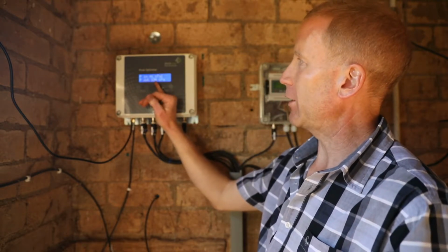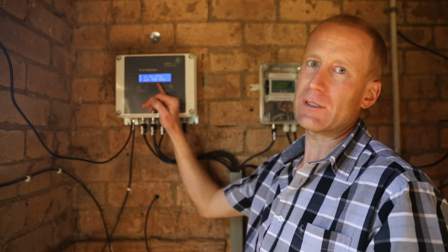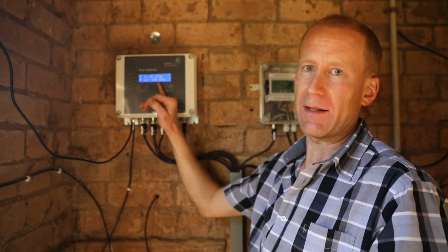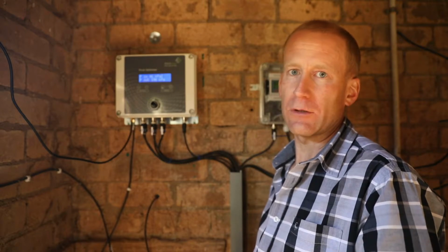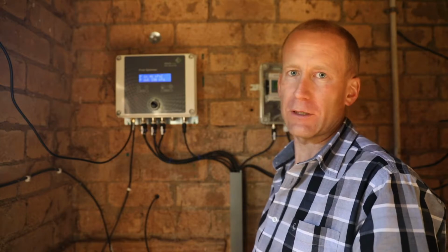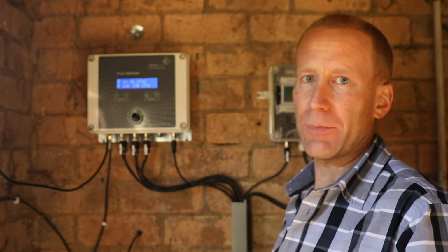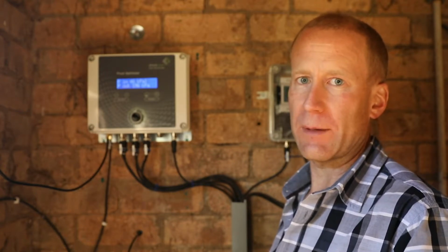The pressure outlet value that we've got is 196 kPa. In this case, the outlet pressure sensor has been installed after the non-return valve, so it is picking up the static head between the pump and the pivot center. In this case, 196 kPa corresponds to about 20 meters of static head between the pump and pivot, which corresponds to the physical installation. The Pivot Optimizer gets its calibration settings from the website, and each particular pressure sensor has got its own calibration range, which must be entered into the website.